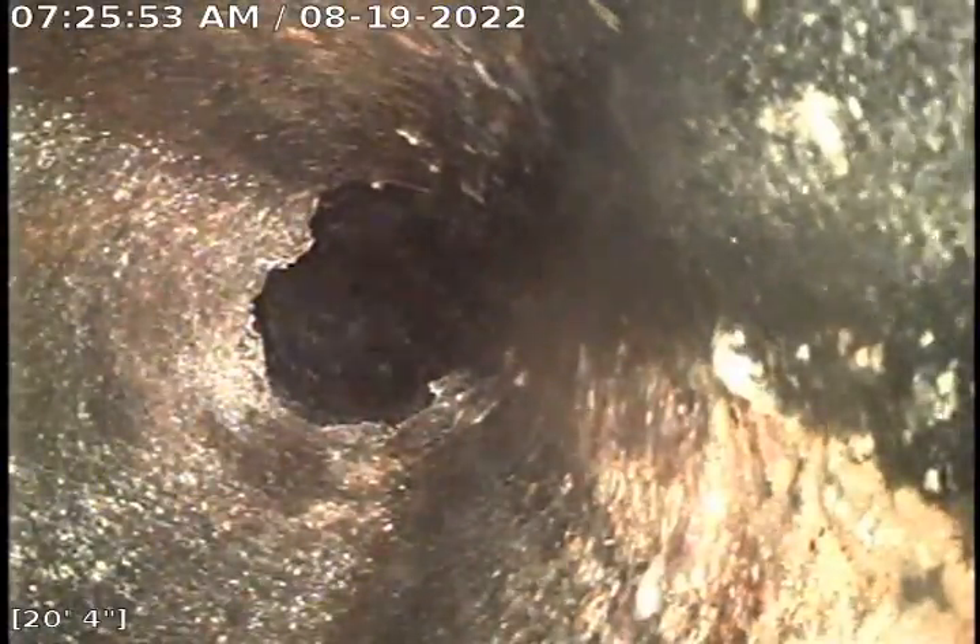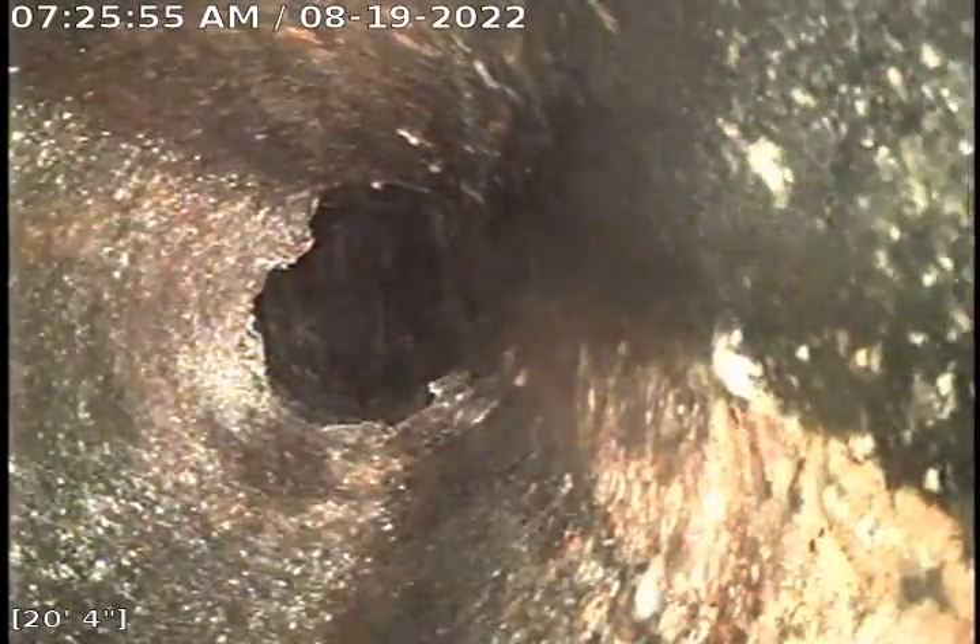You can see the channel rot — there's basically no pipe at the bottom. You can see the edge of where the pipe used to be. The bottom of the pipe from this perspective is the top right-hand corner of the screen. Right here is cast iron pipe, and there's similar channel rot there — the iron pipe is actually gone, as you can see. It's just earth that the waste is moving through now.